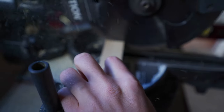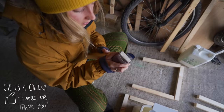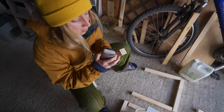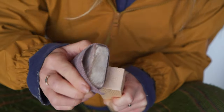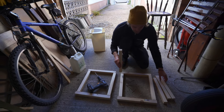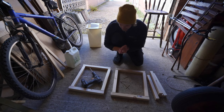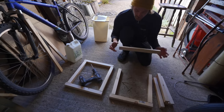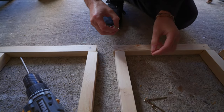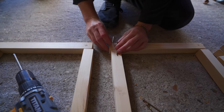Our measurements were pretty much decided for us since we only made the box wide enough to accommodate the bin, thin enough to fit under the seat, and the height was determined by the bin height. While I sawed the battens, Beth made sure they were lovely and smooth. One thing that's very important to me is making sure the edges are all nice, because sometimes you get a really big spike or splintery bits, and obviously you don't want that, so just making sure they're all kind of nice and rounded. We've made our base, our top, and the four legs all cut to size. I've pre-drilled some holes so that when I put the screws in — we've gone for 70mm wood screws — you can screw that way to hold those two together, but also there's enough space next to it to have the screw into the leg.